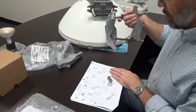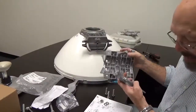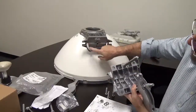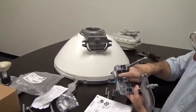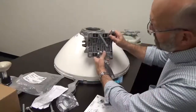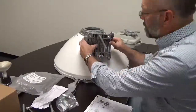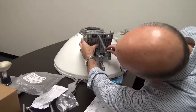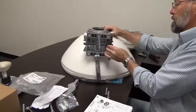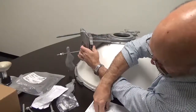Step four involves the fine-tuning components. We've attached the full bracket and clamp and we're now ready to install it on the antenna. You'll notice three slots — ultimately three bolts will be inserted to attach this to the dish. Applying the first bolt, you can see it fits in on the back side. We'll be applying two washers and a bolt.